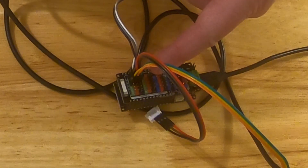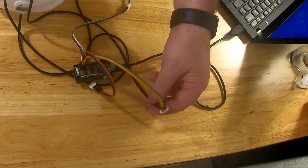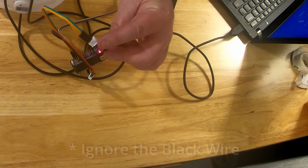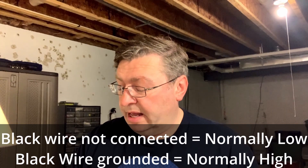They connect to digital pins. I've connected power, ground, and a digital pin. On the unit itself there are four pins — you ignore the last pin. If you do connect that last pin, you can ground it and it will change the normally open configuration of the sensor, but I don't want to do that. So I'm going to start filling this jug until I get to the first sensor and see what happens. I haven't actually used water with it yet — I've tested the code with my hand — so we'll see how this goes.